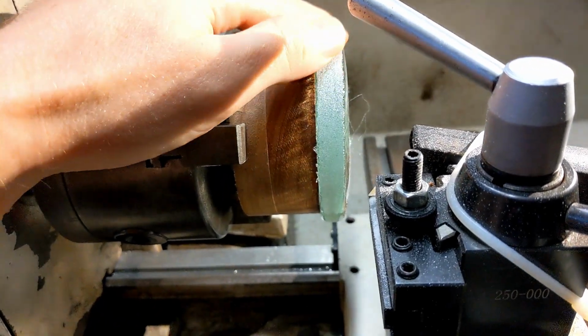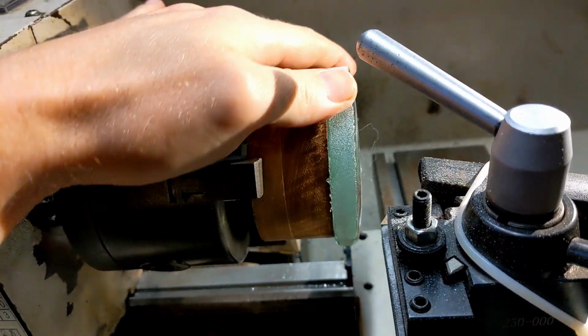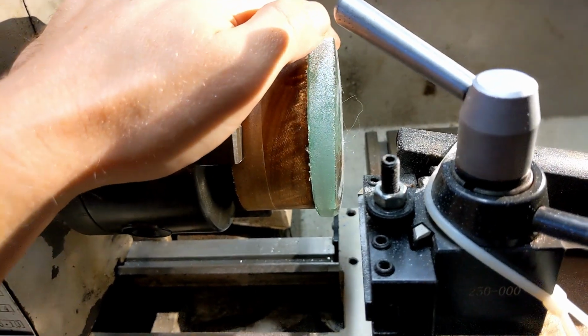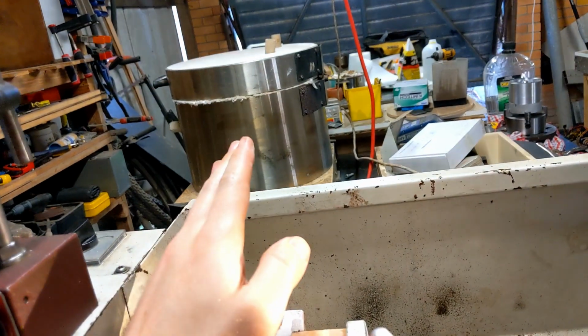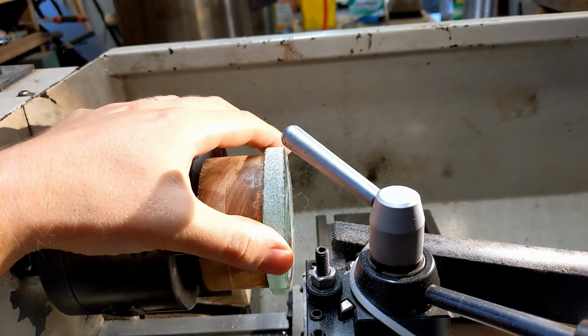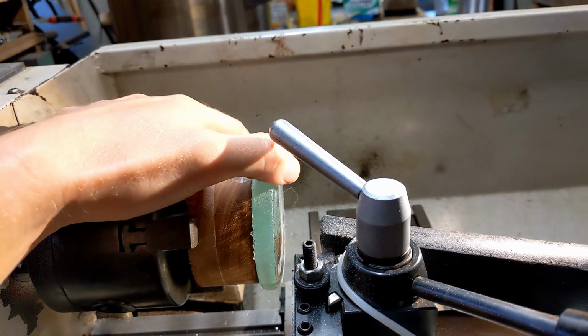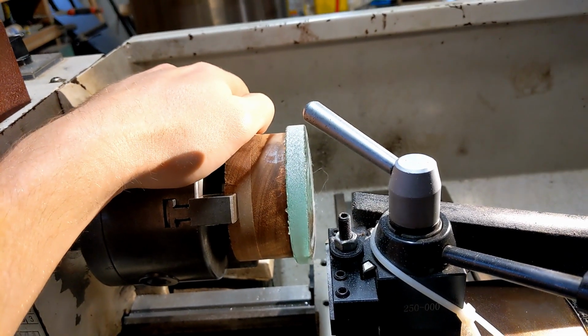So the surface, you can feel it's a bit rough, but once I got it down to the desired diameter, I would then fire it again at the soak temperature, and that would relieve all the stresses that are being introduced as the surface gets all busted up like this. That would sort of tie it together, make it all strong again.